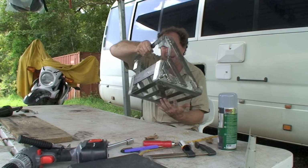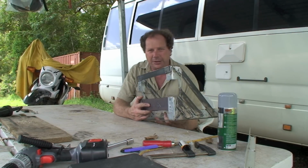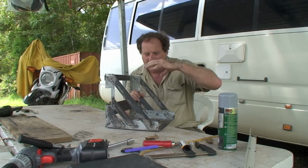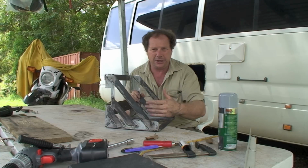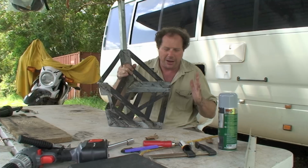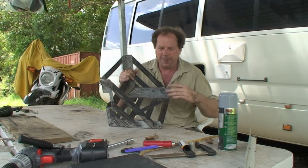And on the back here, you see you've got these little holes, 1, 2, 3, 4, 5, 6. Those holes are where we're bolting it to the chassis. This is an undercarriage battery holder, so it goes underneath the vehicle on the chassis rail. You can find a place, bam, stick it on there. The batteries sit in here. Most batteries are 175mm wide, so we allow a little bit extra and fill the gap with a little bit of marine ply. This length here we haven't determined at this stage because the AGM batteries are different lengths depending on the amount of amp hours. When we figure that out, we'll just put up a bit of angle there as well. Battery sits in here, some type of strap, and it's all good.